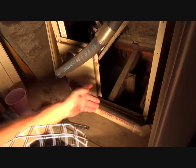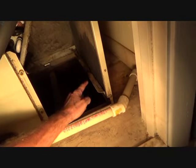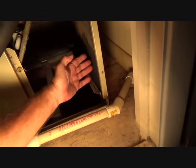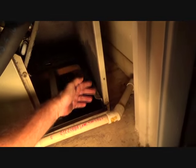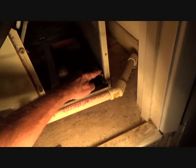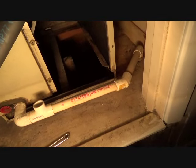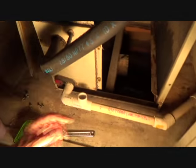But in this case it's not over there — this is all dry. I'm looking over here and the plywood, on the edge of the plywood that's been cut out, you see how it's kind of discolored? That's because it's been wet. Somehow the water has seeped up here and it's run on this insulation. The insulation probably got wet down here, and the insulation works like a sponge — it gets wet down there and just travels uphill. It's come to here, and you can see where it's stopped. So it doesn't even look like it's coming from the pan at all.